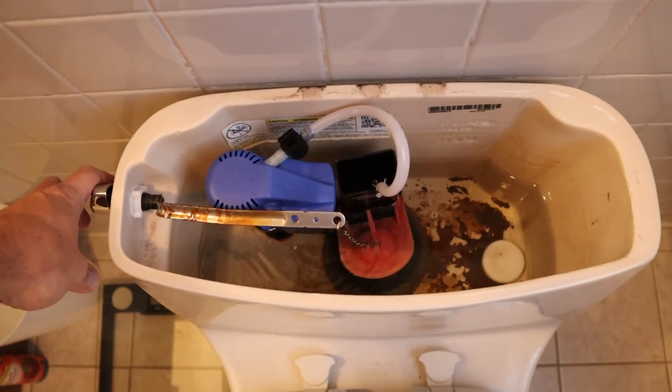Your toilet may start to have small problems like gaskets leaking, and then eventually things will completely break down where parts will disintegrate and fall apart, and your toilet will either not flush or continually run because it doesn't seal anymore. These tablets can also sometimes break apart into larger pieces instead of dissolving slowly, and those larger pieces can actually get lodged underneath the rubber flapper inside your toilet tank, causing your toilet to keep running.